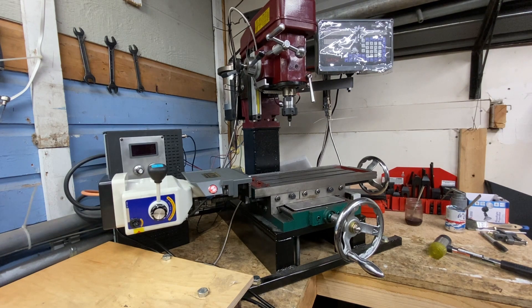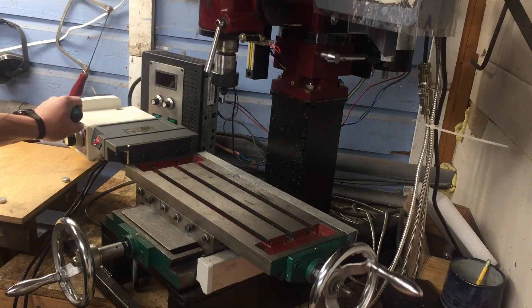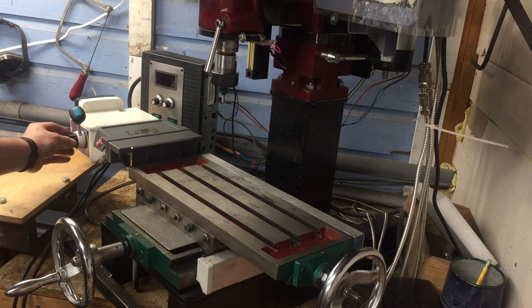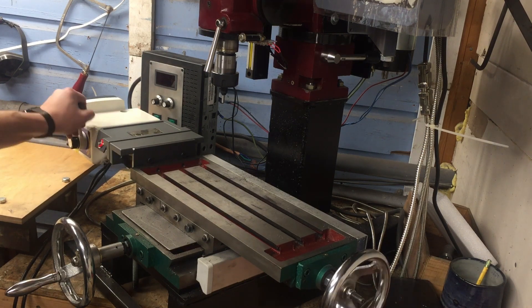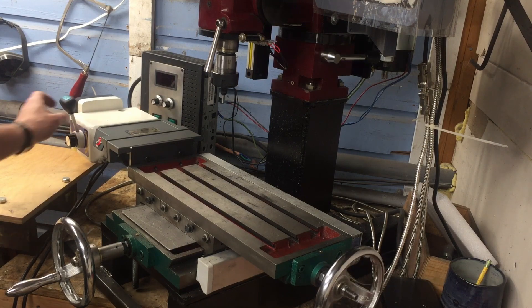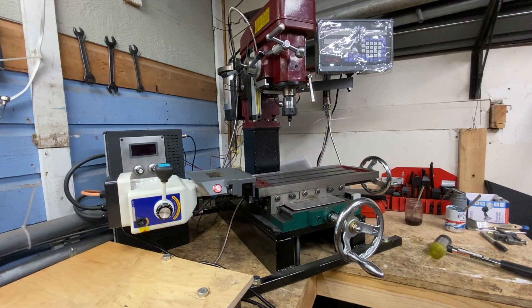With it all installed, let's give it a try. That is max speed — I can go a little slower and then it begins to bind out. The problem is this machine is actually set up for 220 volts, even though it has a 110 volt plug. I currently have it plugged into 110 volts and that's why it's running so slow at max speed. But if I go to 220 volts, I'm pretty sure it will work just fine. Let's give it a try.